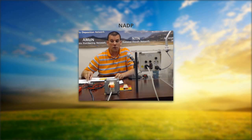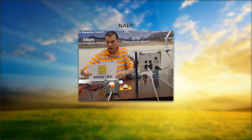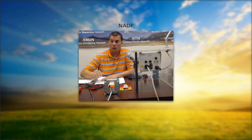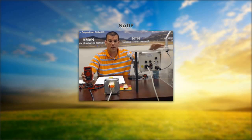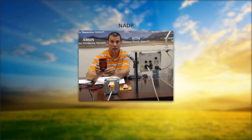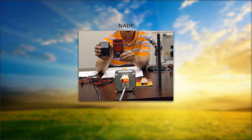The reason we're going to learn the multimeter now is because we're going to be using it through the rest of the webinar to troubleshoot our collector motor box. Turning to page two of the handout: a multimeter is used to test multiple electrical parameters — voltage, resistance, and current. We're only going to be using our multimeter today to test the voltage coming out of our collector motor box and battery, and to test fuse conditions. There are two types: digital and analog multimeters — both are fine.